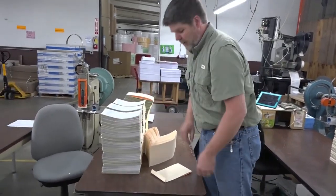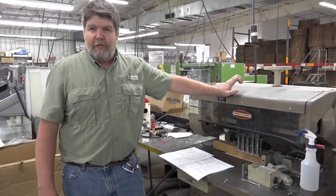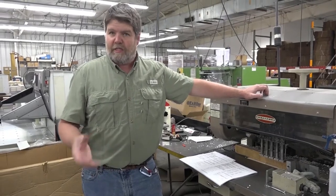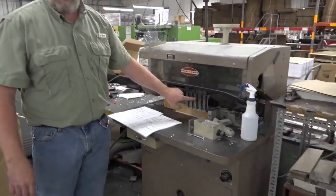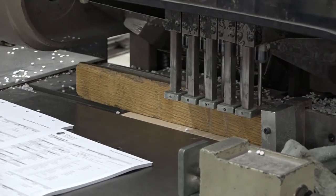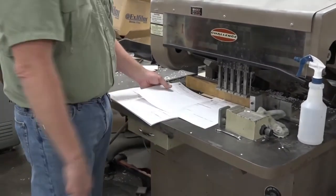It's a good system and it's real popular — we do a lot of books. Another piece of equipment in our bindery department is our drill press. This drills multiple holes; we can set a variety of combinations. The special thing about this is when we punch on the printing presses, those are designated sizes — we can only do standard sizes on the press. So if a customer wants a custom punch, a custom size hole, or multiple holes that our presses won't do, we have to do it offline. Each one of these is a drill and we can set them up on a scale and put them just about anywhere we want. We can change the depth, move the block forward and back, and move the punches side to side, so we can do a variety of combinations. Here's a similar job — I cannot do these on the printing press because of the way this form is produced, so we print the form and then bring it over here and drill those five holes all at one time.